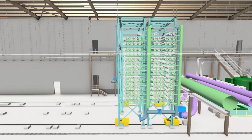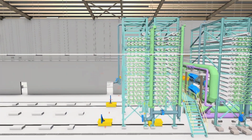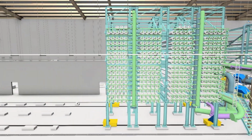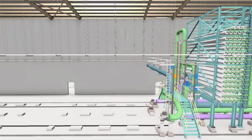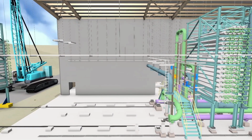Spools are progressively installed underneath the RO racks from transportable lengths forming long headers. From there, the spools connecting these under-rack headers shall be installed, tying them into the RO rack vertical manifolds. Field joints are minimized along with associated construction hazards. All pipework will be thoroughly cleaned and flushed after installation to ensure the sensitive RO membranes are protected from damage during commissioning.